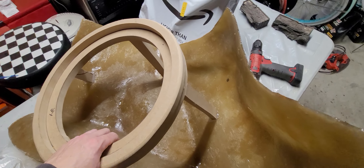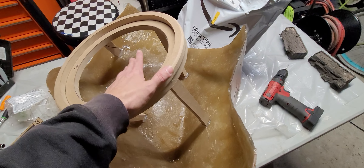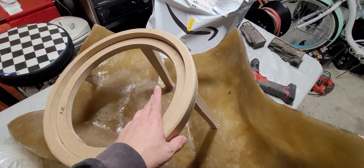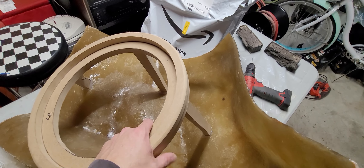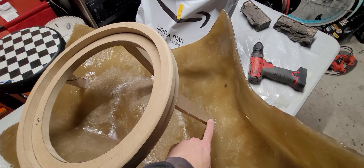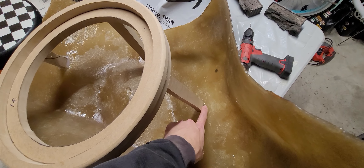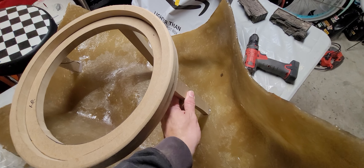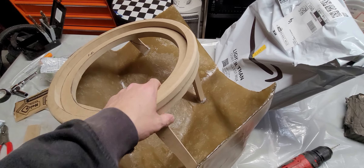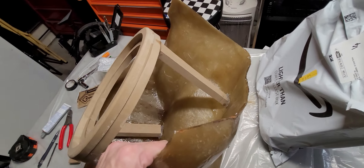It just adds structure, if anything. It definitely doesn't hurt anything. If they break off as the speaker's playing and rattle around inside there, you're going to have to take the speaker off and remove them. But I make sure before I'm done, I'll put some fiberglass mat and resin just around the base and a little resin around here just to help seal these in and give more structure on the box. The stronger these boxes are, the better — the more abuse they'll take from a subwoofer.